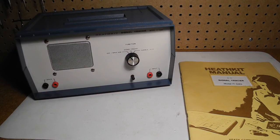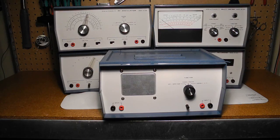The IT5283 is a pretty basic signal tracer. Some older units had more features like eye indicator tubes and a noise function, both of which were pretty much obsoleted by solid-state circuitry by the time this unit was introduced. The audible volts per ohm feature is a little unusual and probably not that useful unless you lack a multimeter, although an audible continuity tester is always useful to have, and the multimeter in the 5280 series lacked this feature. Overall, the instrument was a good value at under $50, and because you assembled it yourself you could service it. These were likely some of the reasons it was offered right up to the point where Heathkit exited the kit business in 1992. This is the fifth and final instrument in the 5280 series that I acquired, but I suspect it will not be the last unit in my Heathkit collection. I'm still looking for a few more models of shortwave radios, and test equipment is always welcome if an interesting unit shows up.